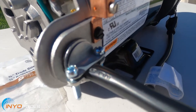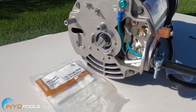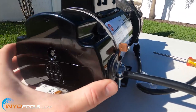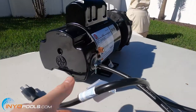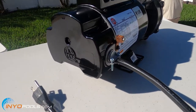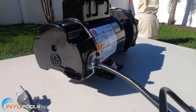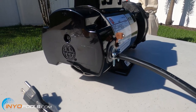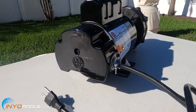I've tightened the screws and you can see it's nice and tight around the cable now. Then we'll take our end cover, put that back in place, and tighten that screw again. The cable is installed so at this point it would be ready to plug in. Before you run it, you would want to get your bonding wire if you have one and connect it there. If you have any questions on how to wire a plug and cable to your pump or anything else pool or spa related, leave a comment down below or visit us at inyopools.com. Thanks for watching.